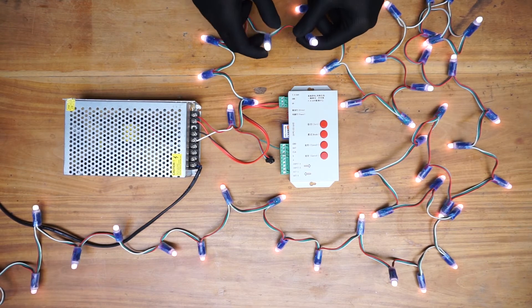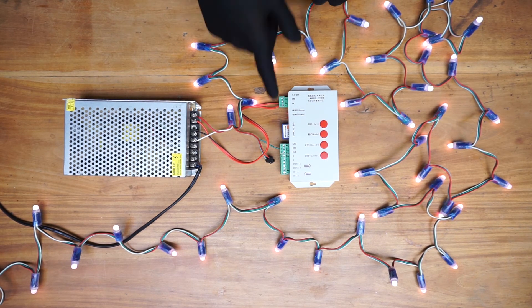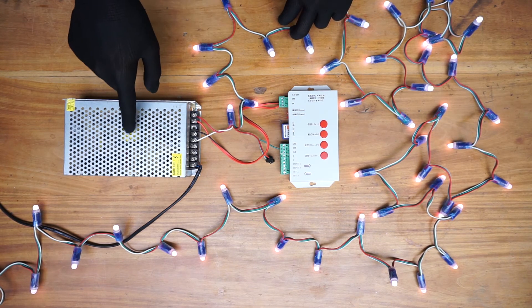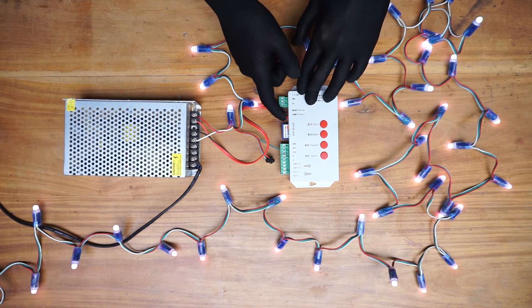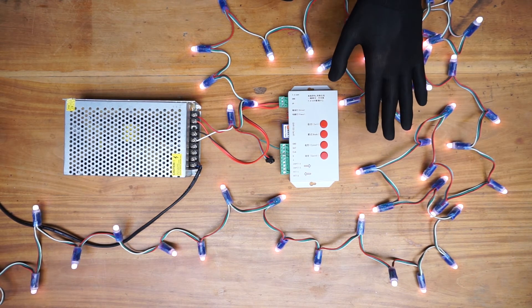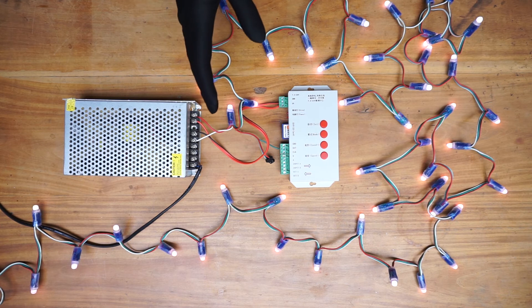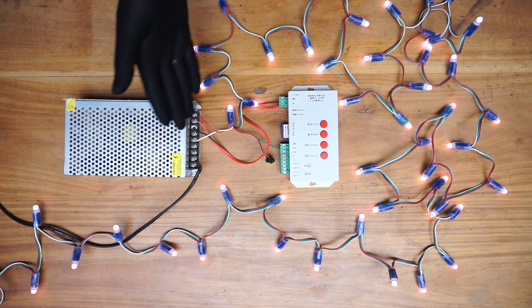As you can see, the pixel LED string doesn't show the pixel LED program from the SD card — instead it flickers with noise coming from the power supply. Also, you can notice the power indicator of this controller is barely lighting up. There is something wrong with this system. Let's find the cause of this problem and see how to fix it. To troubleshoot the system, I'm going to check the voltage of each segment of this system, starting from the input power.